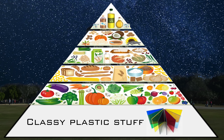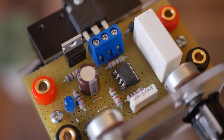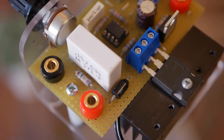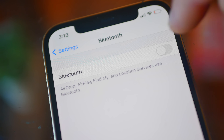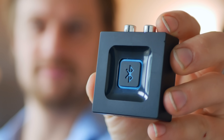So I plan to dig a little bit deeper by adding a few upgrades. First, I added a healthy dose of acrylic, mostly because it sits right about here on my nutrition pyramid. Second, 555 chips which drive inductive loads tend to blow themselves up. To prevent that, I'm adding a resistor, diode, and capacitor to act as a snubber circuit. Lastly, I'm giving the antiquated circuit a modern upgrade: Bluetooth, which is singular for blue teeth.